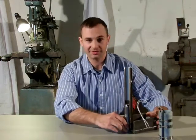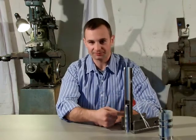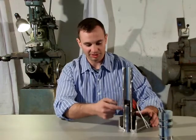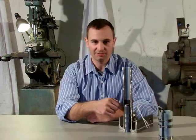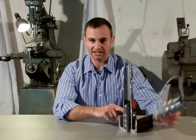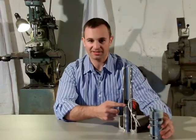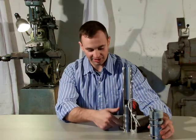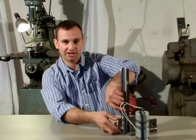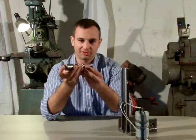It goes in like this, and you can see there is a gap, about 1/8 of an inch, that goes all the way around this core, between this core and this tube. The plastic gets jammed inside this gap, and it gets evenly melted outside by the heater and inside by the plasticizer that conducts the heat from the heater going downwards and then coming up. This plasticizer, or the core, contains all the plastic around it. So if you want to mechanically remove plastic without having to flush out the unit, all you do is press it out from the bottom and it'll come out from the top, trapping all the old plastic around it.